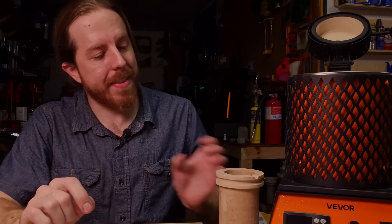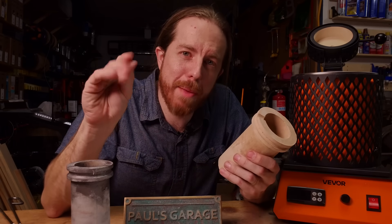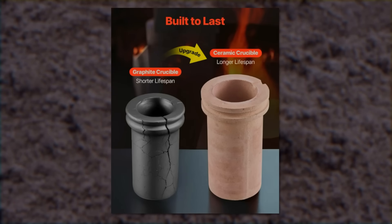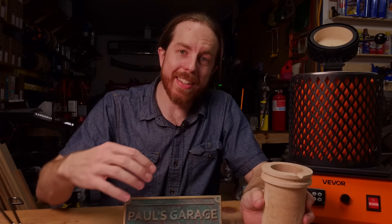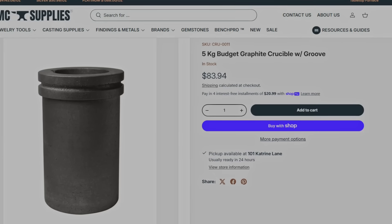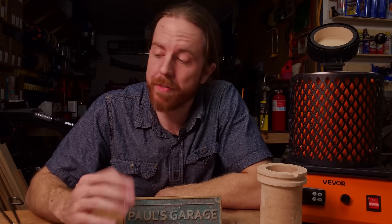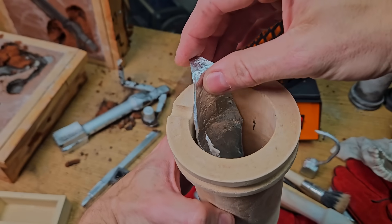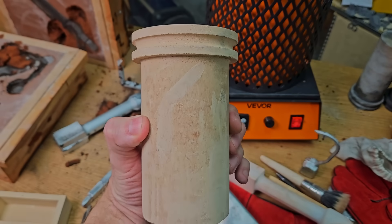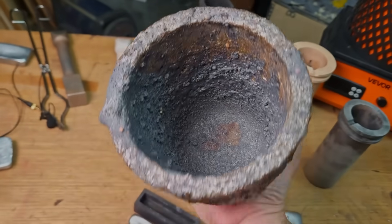Here is where this newer one might be better. This is a ceramic crucible — no longer the black graphite ones like this, which get your hands filthy every time you touch one. They say in the marketing that the ceramic ones last longer, but honestly I haven't had it long enough to tell. The graphite ones were great because the metal would always pour out very cleanly, and supposedly the graphite itself can help prevent oxide defects in the metal for some metals — more important for silver and similar metals. But if you look up the price of the graphite crucibles, they are not cheap, and I believe that's probably why they switched to ceramic. I'm not sure if the ceramic ones will hold up at copper melting temperature, but for ZA-12 they seem to be just fine. You really should have a different crucible for different metals anyway to prevent contamination.